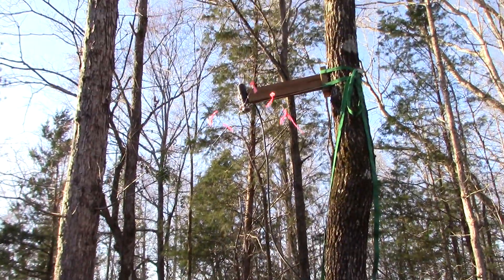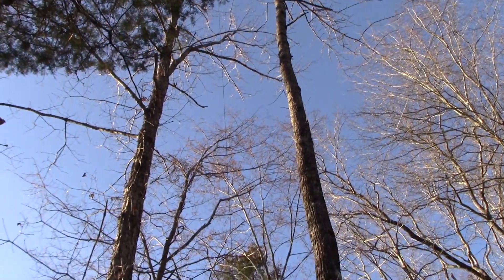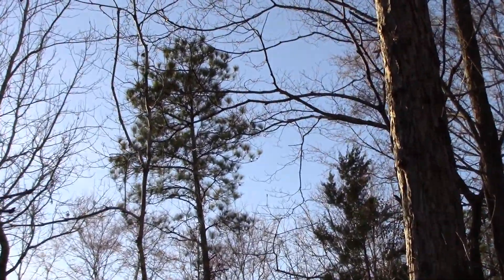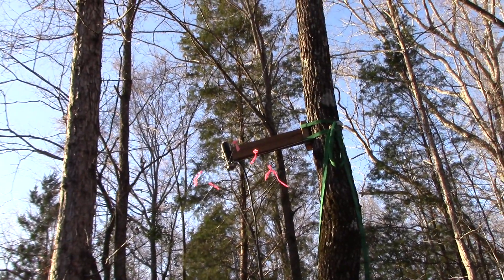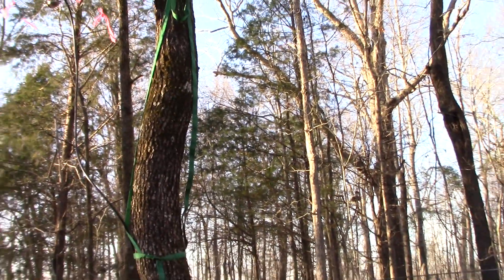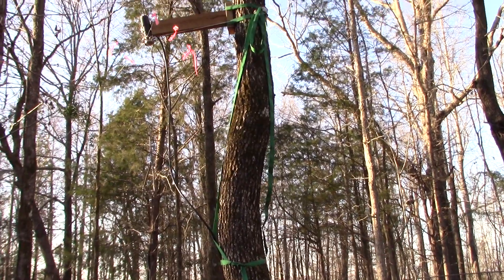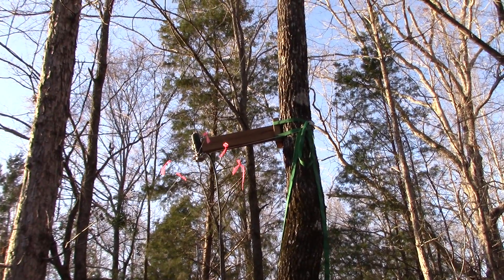The vertical part is 14-gauge insulated copper. It goes up to the top of this tree, which is about 50 to 55 feet to the very top. Then it goes horizontal over to the top of the big pine tree behind us — just about to that tree. There's no coil loading. The first antenna I made was coil-loaded, but there's so much loss in those, so we went to a bigger quarter-wave vertical. We're feeding that with some LMR-400, about 140 feet of it going back to the shack.